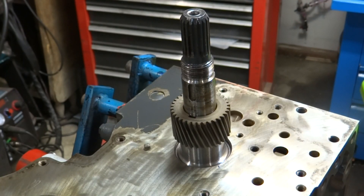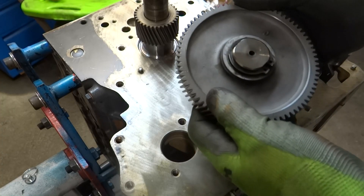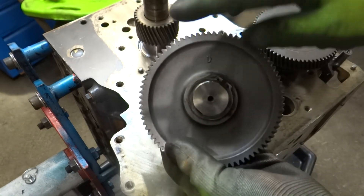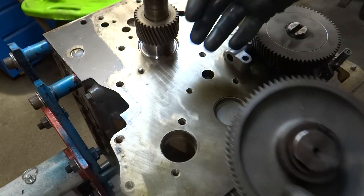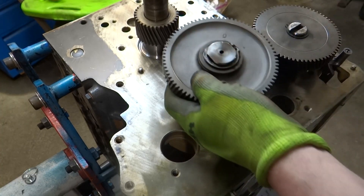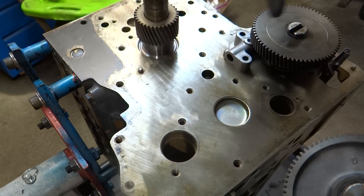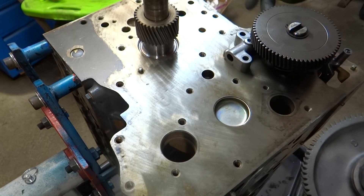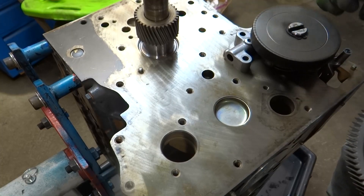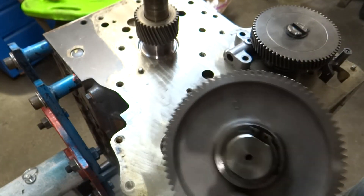It's been so long since I took this apart. I have the manual but it's not telling me everything. My original idea was to put the timing gear on first and time everything from the inside out, but when I put it on I realized it was blocking a hole and a pin. I had to remember that those pins are there to mount and align a component, so I'm going to try putting that gear on last.